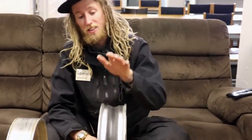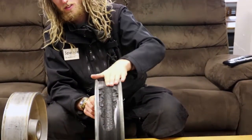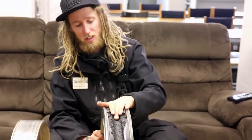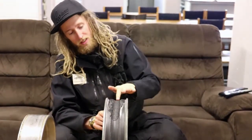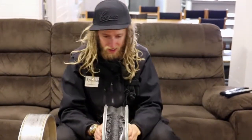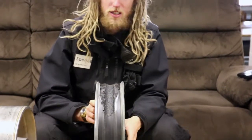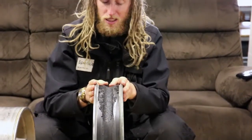If you have a look at this sheave here, this one has been stuck for a very long time and as I roll this one around, you can see there is a really substantial groove here. Once freed, it would be rotating around and you would get this big bumping every time the sheave would spin, which is really not good. So this one needed to be replaced - the cable has ground all the way down right through here, taking a big chunk out of it. That can be expensive to replace, so if there are lots of sheaves that are missed, that's a lot of money out of the budget. So that is basically why we de-ice.